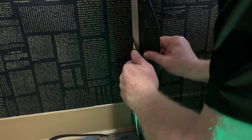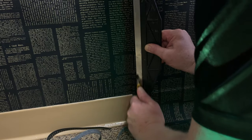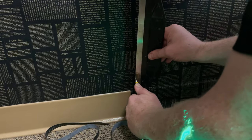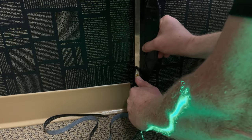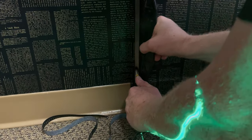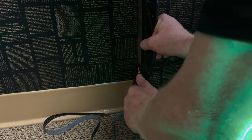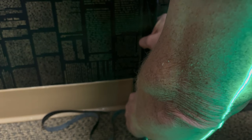Now, watch this. As I come down, I'm gonna change the angle of my hand if I have thick woodwork. So I'm gonna just do it for you. Imagine thick woodwork, not a cove base. And so what happens is I gotta bring this edger out so my blade doesn't take off on me. I'm trapping the blade against my edger, and I got woodwork. Think about woodwork now. You raise your hand up.